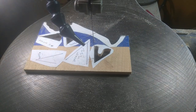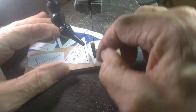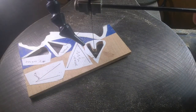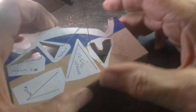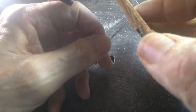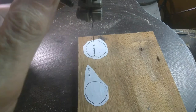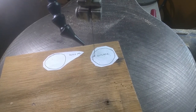That gives me a good sharp point right there. If I didn't want to go all the way around I could turn around and back in again, but if I can come back from the other direction I prefer to do that — it makes a much cleaner cut. Now I'm going to switch pieces and show you what you're getting into with a circle, both internally and externally. It's not just circles — anything with a curved surface that you're cutting into the curve.